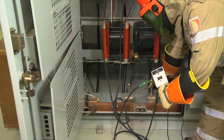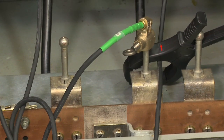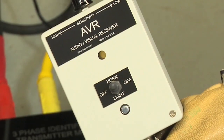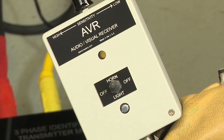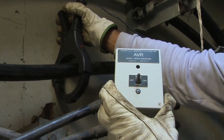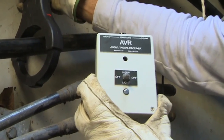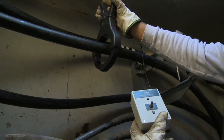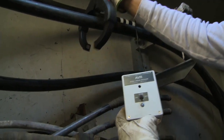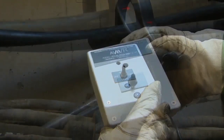To verify the receiver is functioning properly, install the receiver's CT clamp onto any one of the conductors with the CT clamp red arrow facing away from the sending unit or transmitter. The DAVR has two indicators for pulse verification: an audible beep and an LED flash. For the red or A phase, there is one beep and one flash. For the yellow or B phase, there are two beeps and two flashes. And for the blue or C phase, there are three beeps and three flashes.